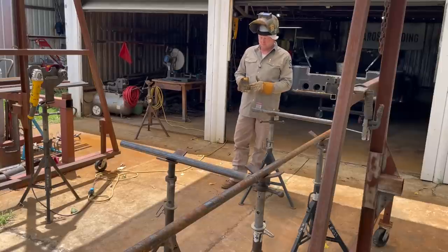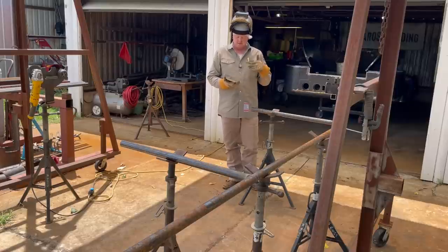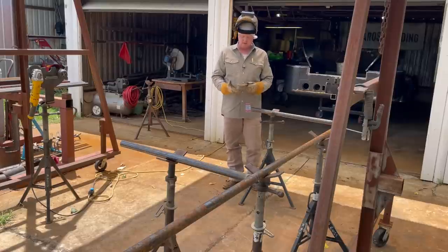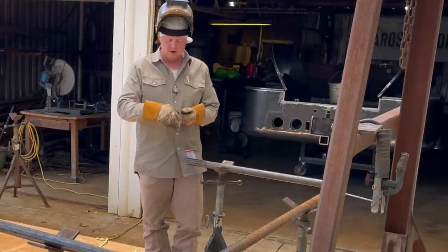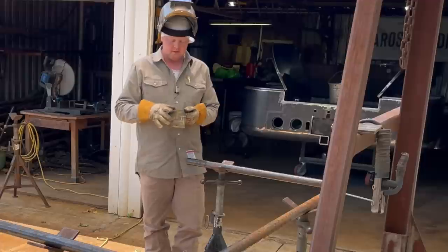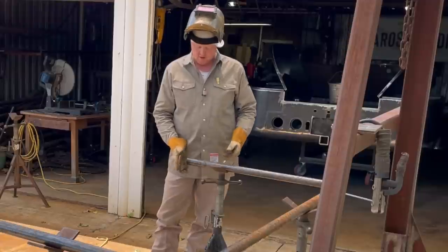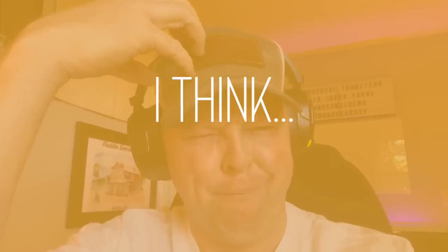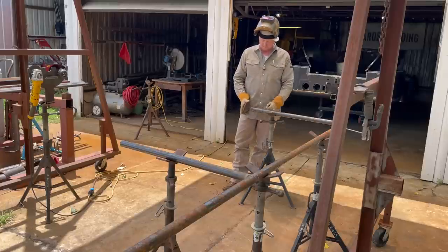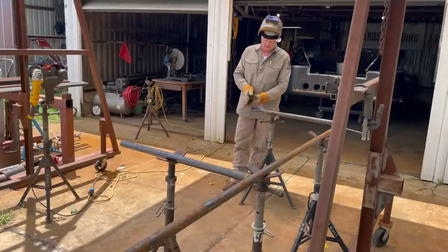All right, now that I've got my foot plates laid out, I got these made with one side straight and the other side just radiused. Just my personal design, because I didn't want the bolt holes to be close to the edge of the concrete. So I moved them over, but anyway, long story short, I wanted the bolts to be away from the edge of the concrete. So I designed this. Well, the straight edge goes down on the bottom. So to make it easier to put these on, I'm gonna flip this handrail over. That way I can set my level like so.